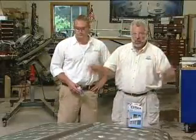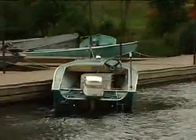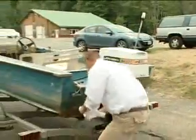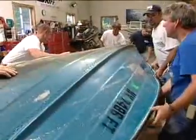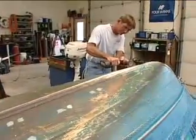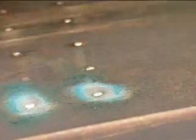Let's bring everybody up to speed. There's a lot of work that has taken place on this hull bottom. We began with the boat in the water — we wanted those rivets to leak, we wanted some water in the boat. We pulled it out at the boat ramp here at Burke's Marina. You went underneath with some paper towels and a Sharpie and identified most of the rivets as working or leaking rivets — along with the keel seam. You instructed the staff to use wire wheels and wire brushes to hit every rivet and remove all the paint. We need to remove any paint or debris to give G-Flex a good clean surface to adhere to.